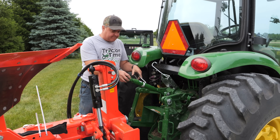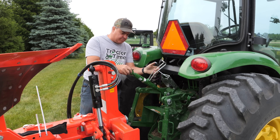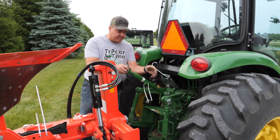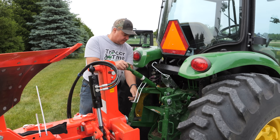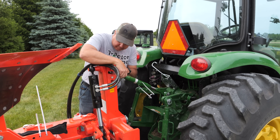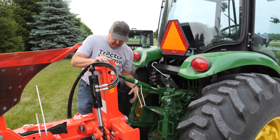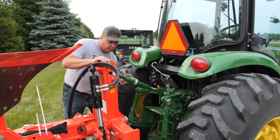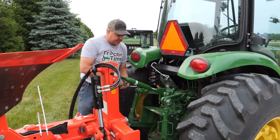Now I need to lengthen the top link. When you do that, don't just grab one end and start screwing it — that means you're only taking out half the top link at one time. You've got to turn the whole thing, so hold this end and rotate. This one is really nice and smooth. I need to lube it up so it stays that way. I'll tighten it back up as much as I can, but at some point it gets too tight because I'd be trying to lift the whole back of the plow.